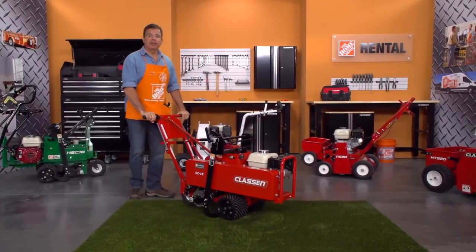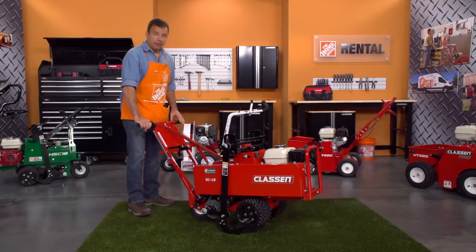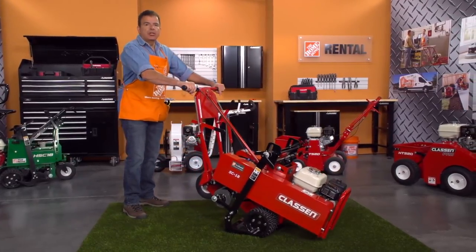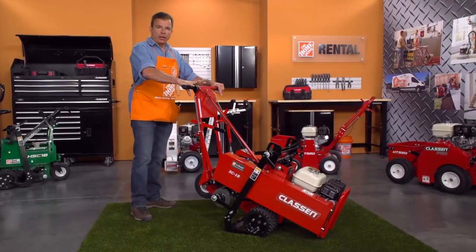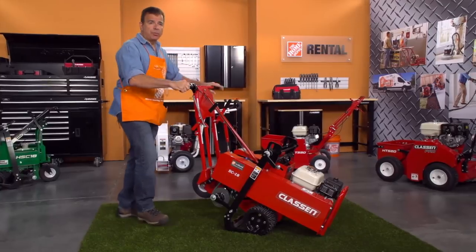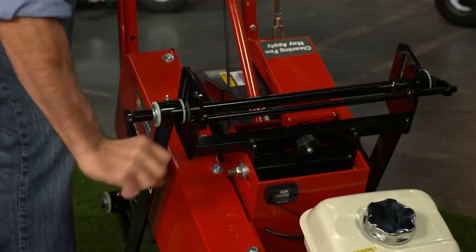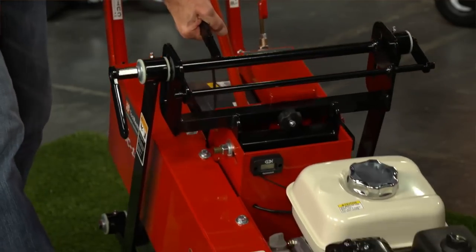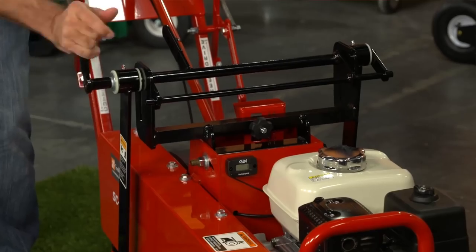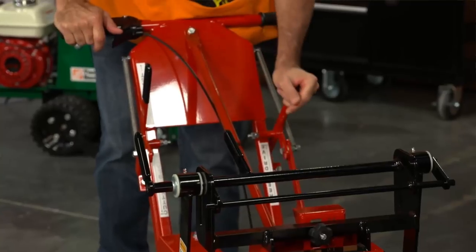When your job is completed, move the wheel drive lever to the off position. Lift up on the machine while depressing the throttle so that the blade cuts out of the sod and allow it to shake off loose debris. Release the throttle, then raise the cutter blade lever to the off or upward position. Loosen the half-inch handle nut on the upper right side of the sod cutter and raise the height adjustment bar, then re-tighten the handle nut securely. Move the wheel drive lever to the on or downward position.